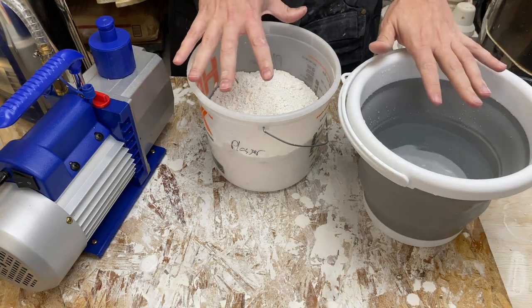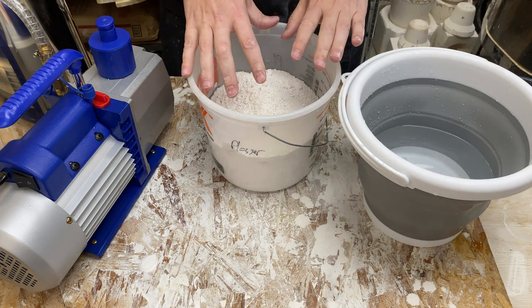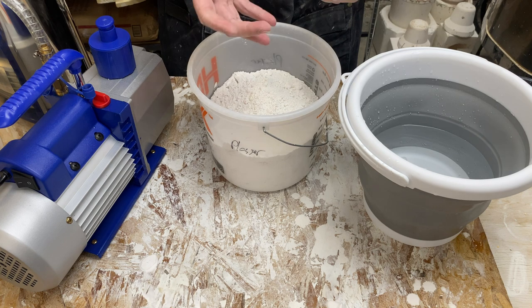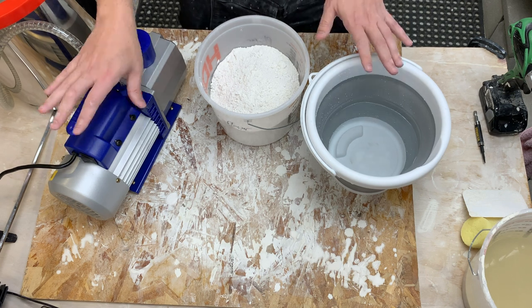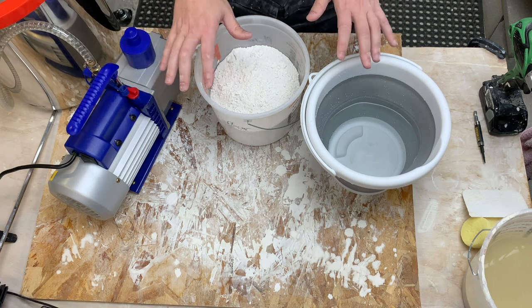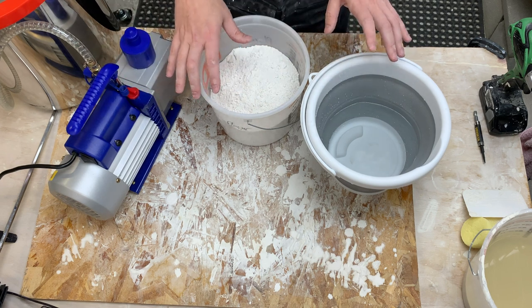I've heard of doing something similar with plaster: mix the plaster together, degas it to pull all the bubbles out, then pour that into the mold. I don't think we can degas the mold itself since I'm 3D printing these molds - there are voids in there and the vacuum would potentially deform them. This probably isn't a solution for everyone, but since I've been making a fair number of molds recently I wanted to see if I can find something that would consistently work. I think with the right combination of all those other variables you can get something very effective, and that's what I've been showing in my channel recently.